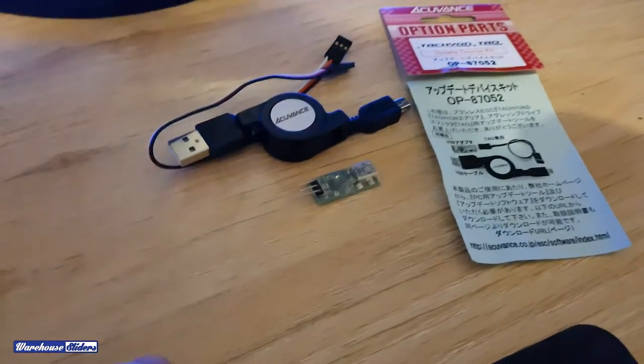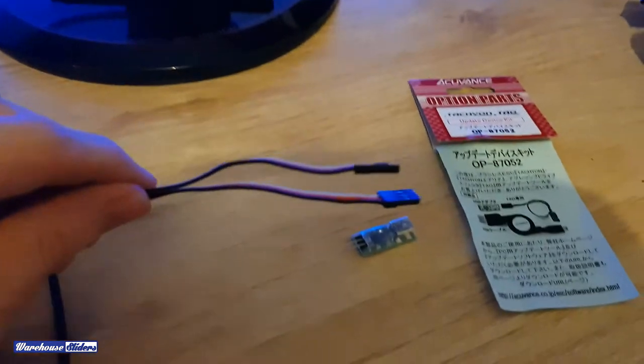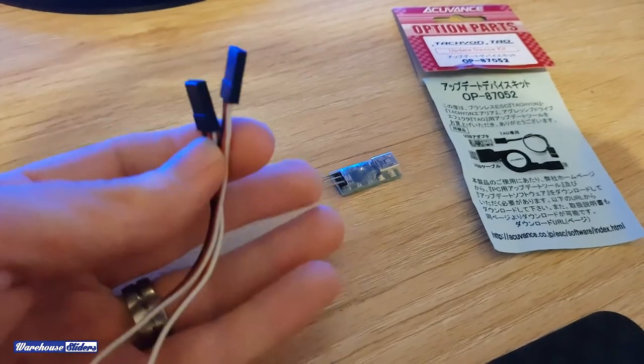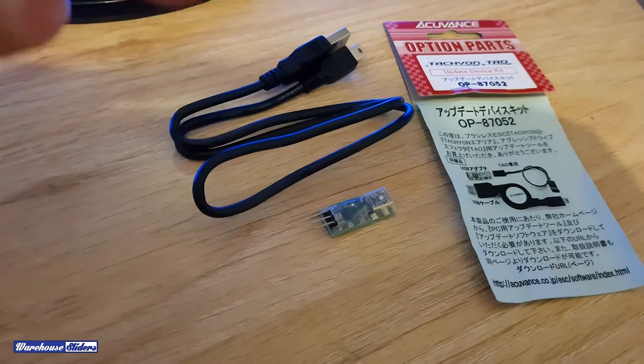The USB cable that comes packaged, I'm pretty sure, is just a charge cable. If you have connection issues to your PC, this could be the cause. The ESC adapter comes with a female to female cable, which is useless as an extension cable, so throw that off to the side. Find another USB to mini USB cable.